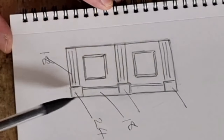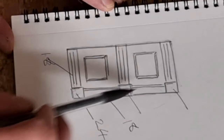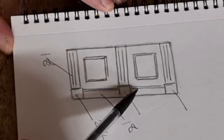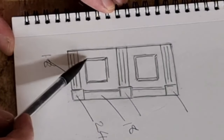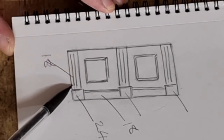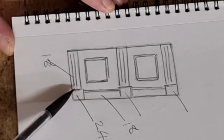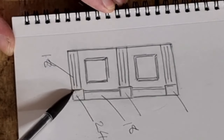This is the frontage of the bar. The first thing we're going to look at is these three blocks — they make the base of each pillar. In between the pillars we have skirting board, and above that these squares are made out of dado rail and they're going to form the panels. The pillars are 18mm MDF, and these small blocks at the bottom are 150mm by 150mm at 24mm MDF.